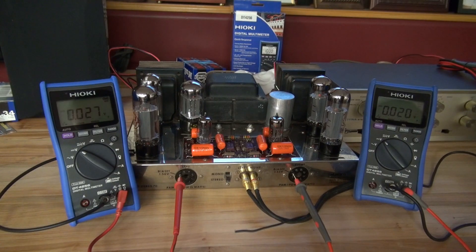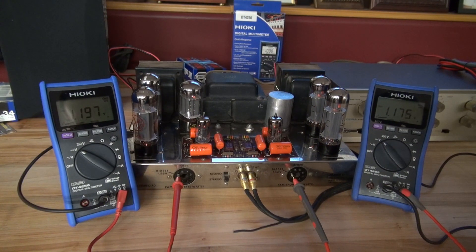I'm going to put in another set of JJ tubes on that channel. I've replaced the tubes on the left channel — the right channel still has the original tubes — and I've readjusted the bias to approximately 1.2 volts again. I'm going to watch that channel and see if there's any more drift, because maybe it's not a tube. Maybe one of your capacitors is leaking DC and changing the bias to those output tubes — even though these caps are new, that could happen. They're looking pretty stable at this point, and they're holding much more steady than the last set by far.